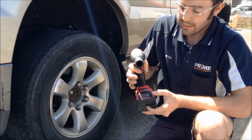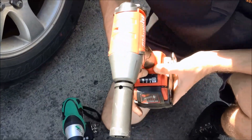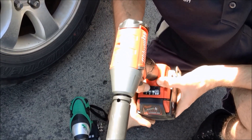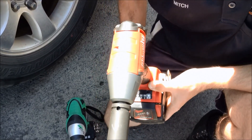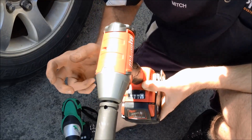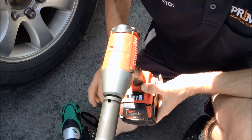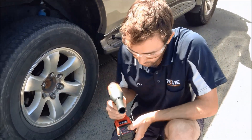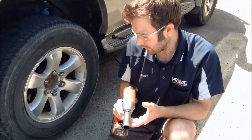Like the Hitachi, the Milwaukee has multiple modes: mode 1, 2, and 3, delivering approximately 100 Nm, 220 Nm, and the full 300 Nm respectively. It also has an auto-stop function — it'll impact for around a second once the fastener is tight, then shuts the tool off to protect surrounding materials. We've got a fully charged 5Ah battery, so we have a clean playing field.